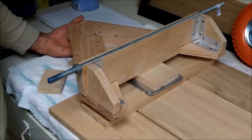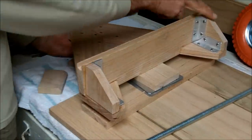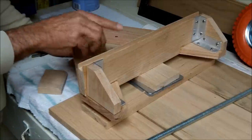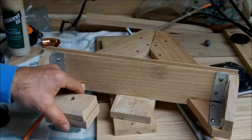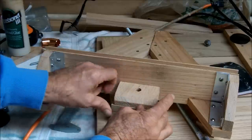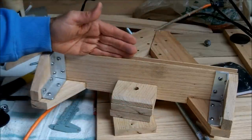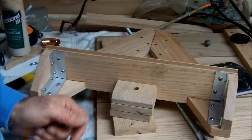I finalized the assembly of the yoke and axle board, and I've installed braces behind the axle because the forward movement of the cart is going to be pushing this weak point backwards. On the back side of the tongue, I'm going to be installing three blocks of wood and gluing them. The shaft will go through there — I've decided to put it 3/4 of an inch back from the axle wood so as to allow a washer of adequate size to fit there as well as a wrench.